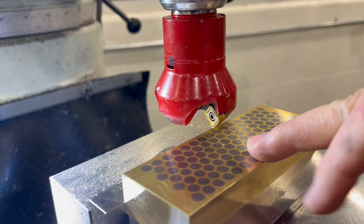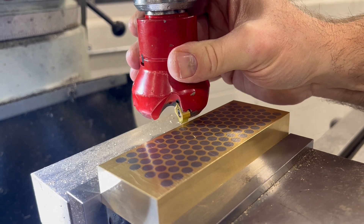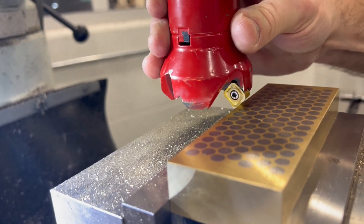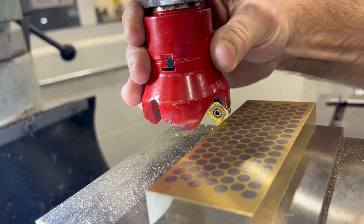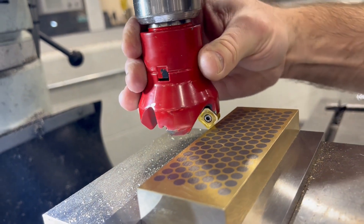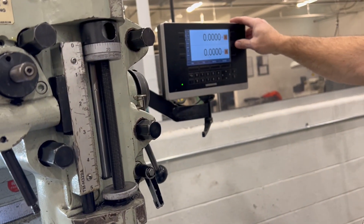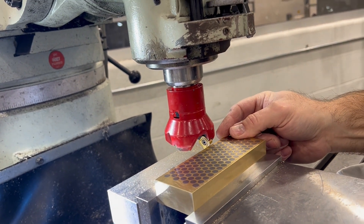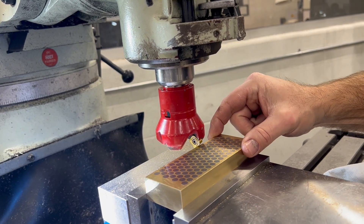Moving the work piece in while rotating the cutter backwards to get a friction feel. When I'm hitting I can't physically turn the cutter. Now I'm moving away and I'm clear — so now I'm at zero. I can zero my readout here and move in. I'm going to do about 65 thou and see what it looks like because I don't have any real dimensions on this piece.